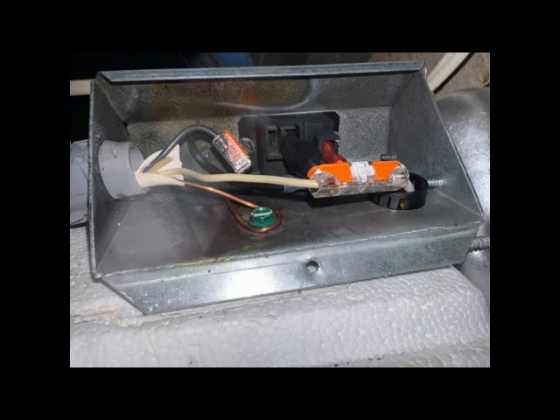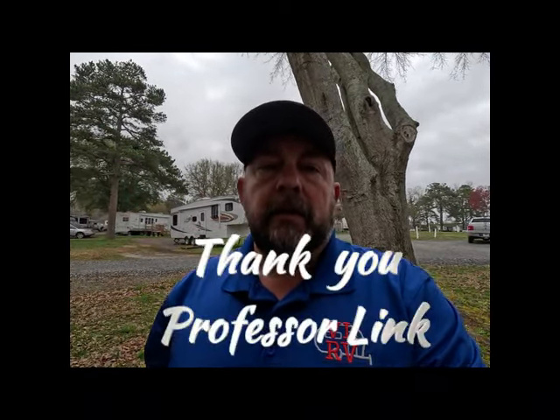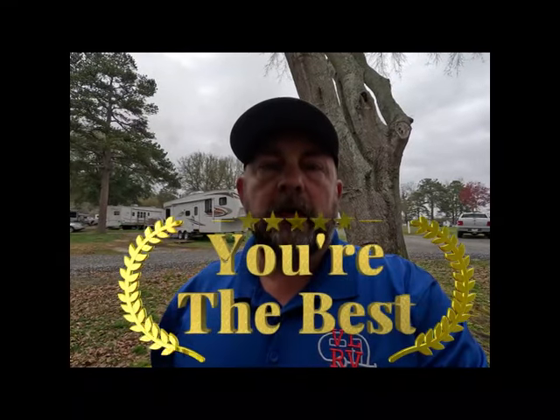The problem, as you saw in the pictures, is a burned-up wire connection. Wire connections are almost always the problem when it comes to amperage issues and thermal events like what we saw in that junction box. Thank god it was in a junction box - those connections can get incredibly hot; I've seen the styrofoam melt around them. He's got better connectors in there now, we've tested it, and we've got 120 volts at the element. He should have plenty of electric hot water now - good to go.